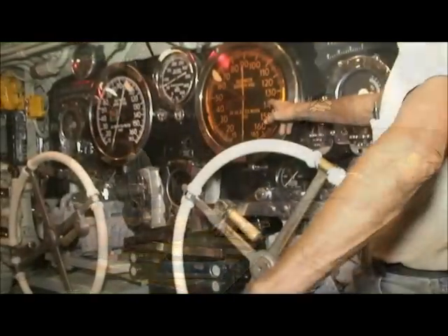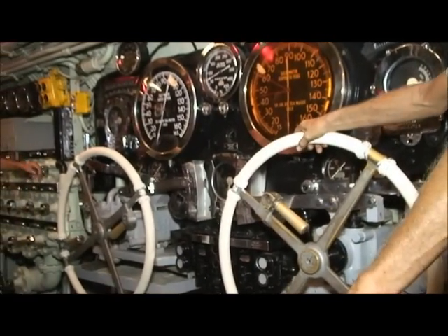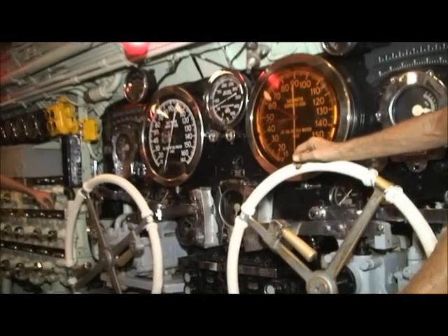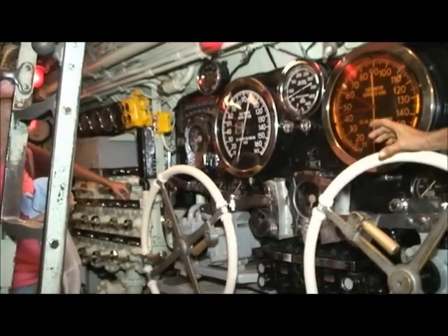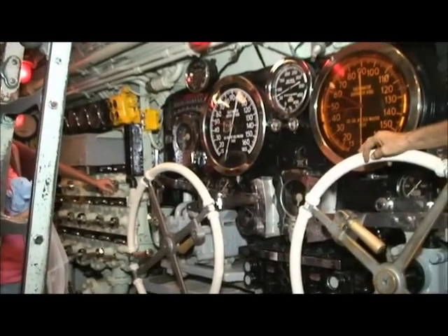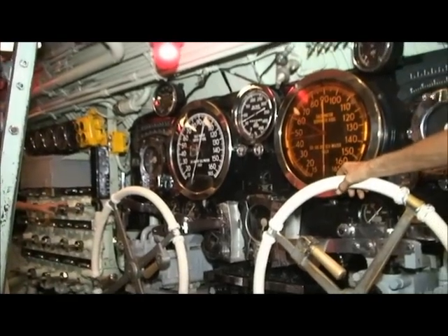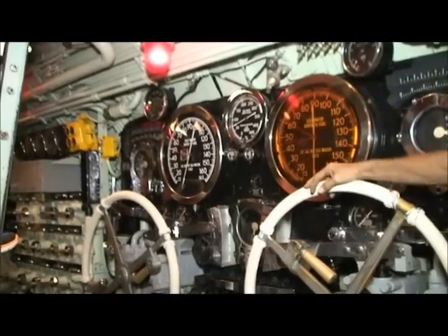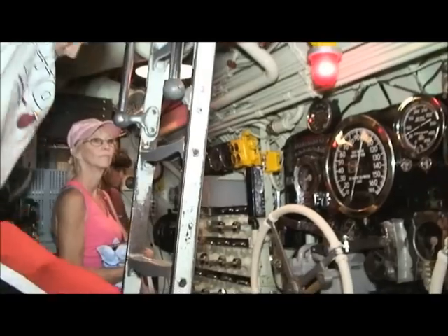They placed eighth for tonnage sunk. These are shallow water gauges — they have bigger increments for finer depth control at periscope depth. A lot of times the skipper would ask for six more inches of scope out of the water, or a couple inches less, so it wouldn't be spotted. Back in the corner we have the trim manifold to pump water to and from the trim tanks, and behind them is one of the radars.